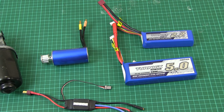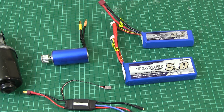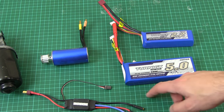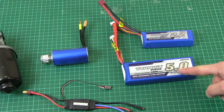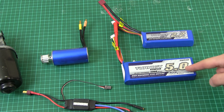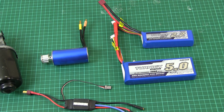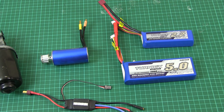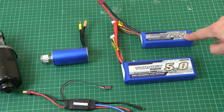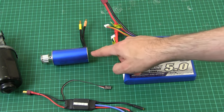For providing that sort of current, I've got some batteries here: a 2.2 amp-hour and a 5 amp-hour 11.1-volt LiPo. These are rated at 20 to 30C, meaning you can draw 20 to 30 times the rated capacity all at once. For a 5 amp-hour battery, that means I could draw somewhere between 100 and 150 amps in one go and it would be happy. It wouldn't last very long, but the 2.2 amp-hour can provide about 40-plus amps, which should be enough to power an 80-amp motor even flat out.